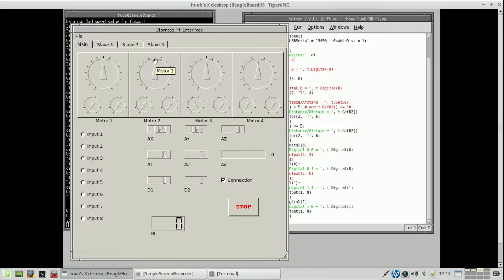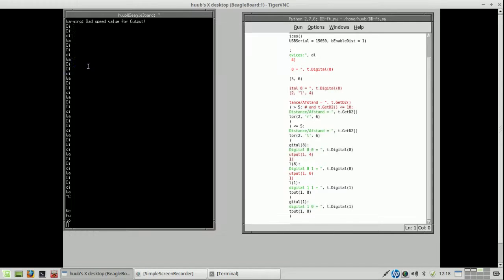And by shear force I made the carriage derail, and you see here it is behind. It is now at the light sensor part of the track, and input 8 is 0. So I put it the other way around, and already as soon as it leaves the sensor it goes to 1. So this proves that in the diagnosis interface it still works. No problem there.